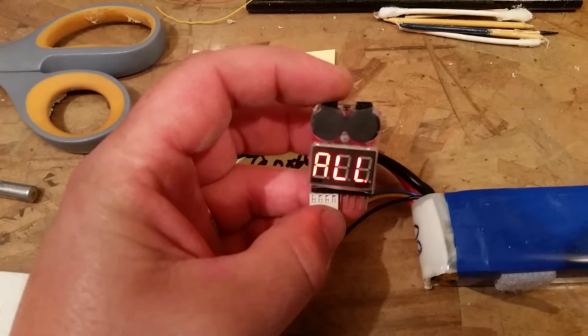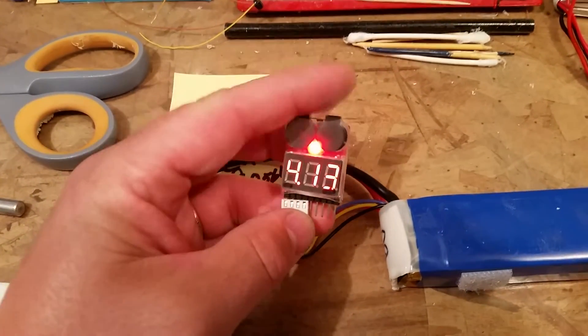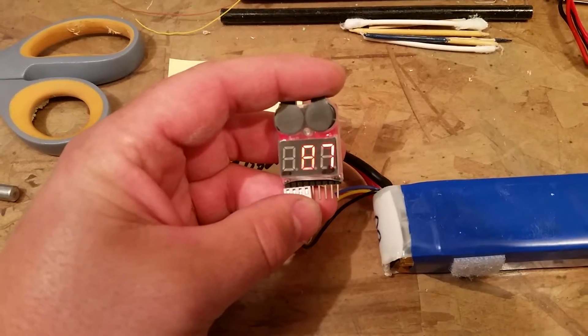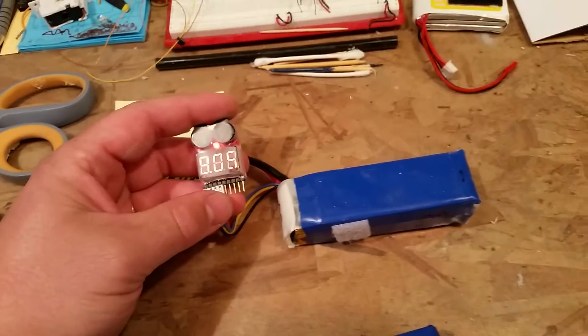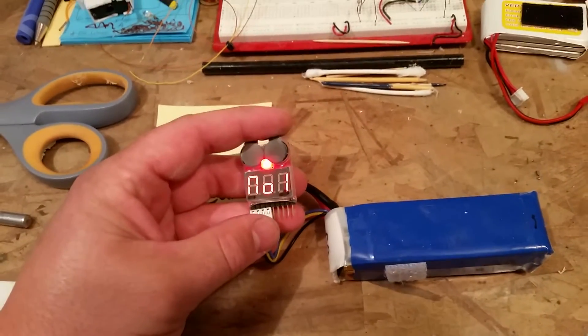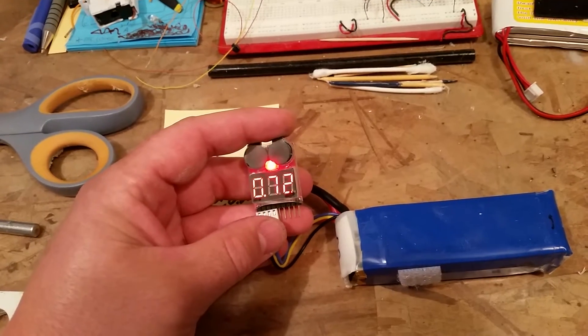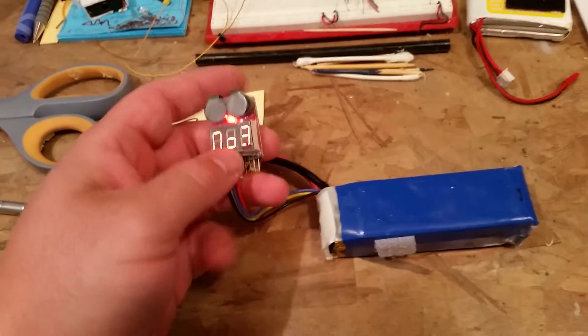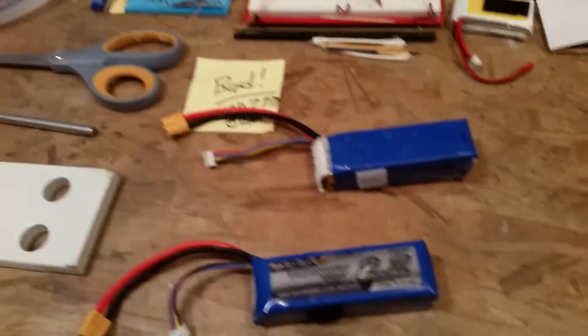Plugging it in here on the three-cell pack: total 9.37V, cell number one at 4.13V, cell number two is bad at 0.84V, and cell number three at 4.15V. That means we either had a genuine loss of cell number two, or we have a wire that's detached. My guess is a detached wire, however I've been wrong before.